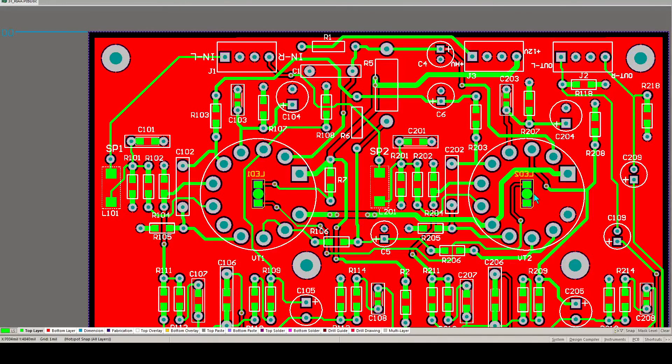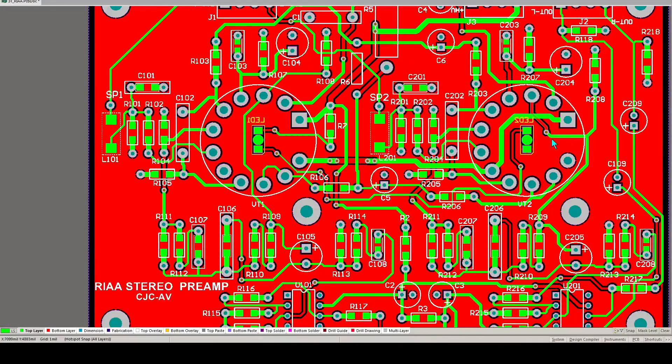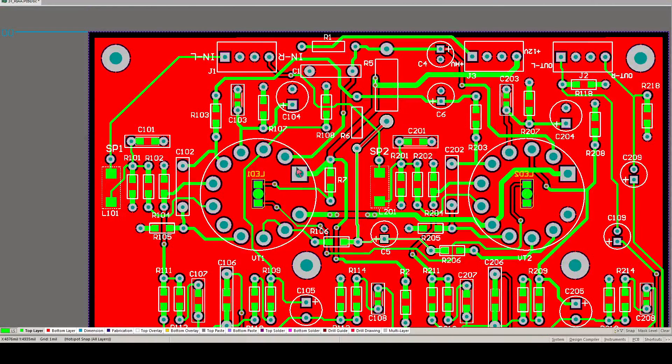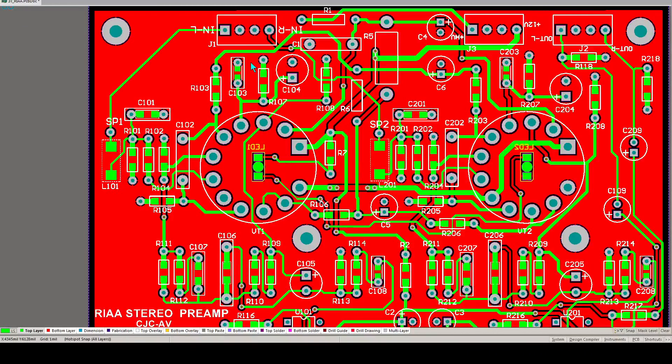Just for fun, I put an LED underneath the tube that'll put a little blue light there. The layout shows two Compactron tubes and op-amps for the output buffer, with all inputs, outputs, and power terminals on the back of the board — all wires come in on the back via screw terminals. Once built, I'll need to tweak the components for the RIAA curve, then do a frequency response plot against the standard curve to see how well it fits. Now it's time to order boards.